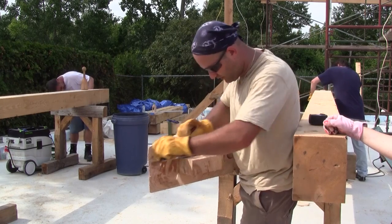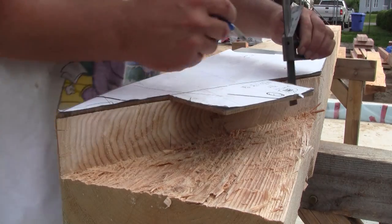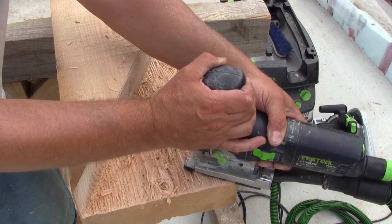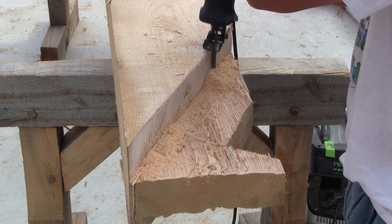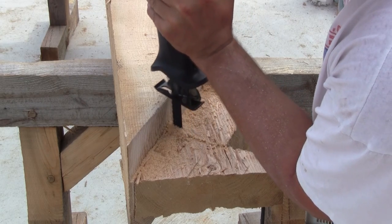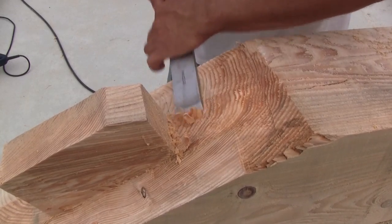When Eric is finished with his braces, he begins to make tenons. Here's how they're done: after Christiane removes the bulk of the wood, with my pattern I find the placement of the tenon and double-check it. Then, with a square, I trace the cheeks. Using a jigsaw, I cut most of it, and the rest is cut with the reciprocating saw. Then all the surfaces are worked with hand tools — unless there's a knot, but only Vincent got the knotty ones.